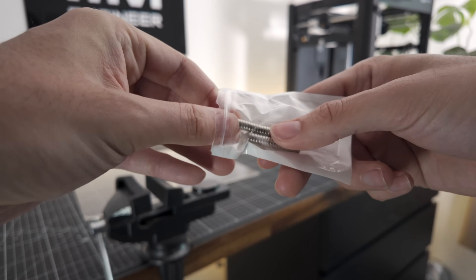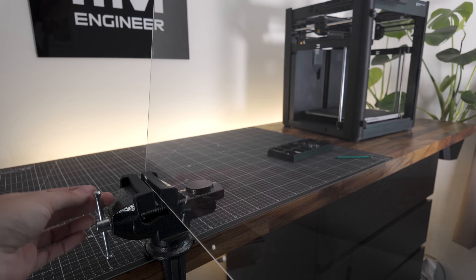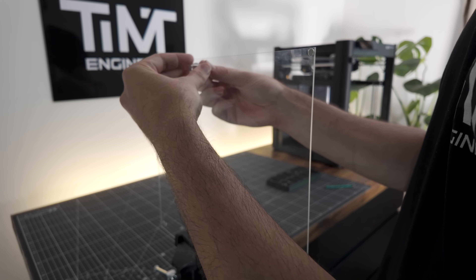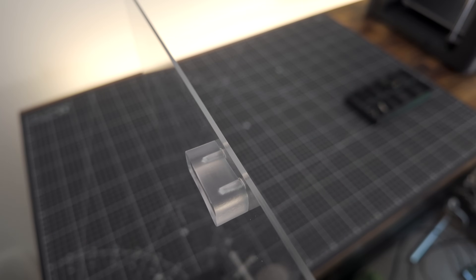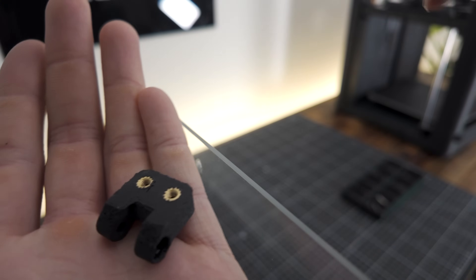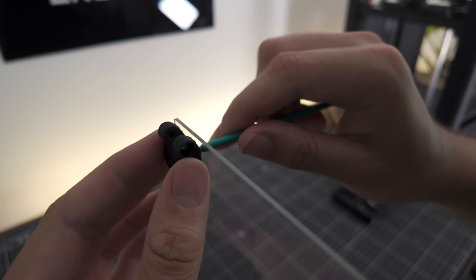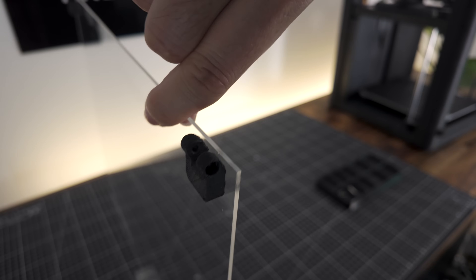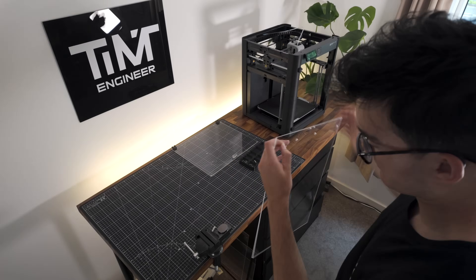Now that the panels are done I can start mounting all the parts that go on the panels, starting with the magnets. I initially used the vice press to press fit the magnets. One modification I made was adding 12 millimeter acrylic handles — because what's a transparent enclosure without transparent handles? Last but not least the hinges are mounted, as these undergo a lot of stress and are the only parts that truly make sense to print in nylon carbon fiber. I then switched to hammering the magnets in, carefully tapping gently to not weaken them.